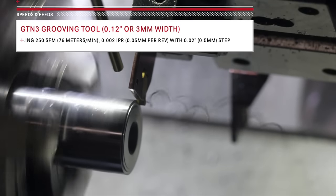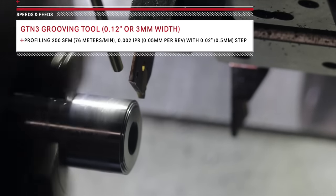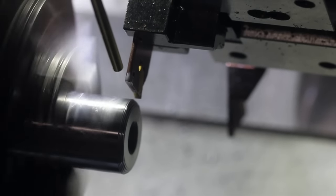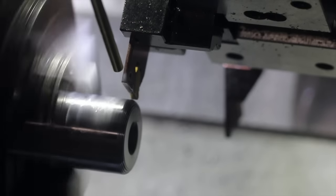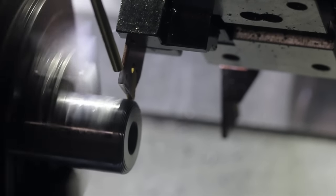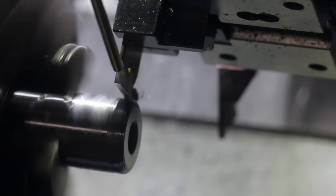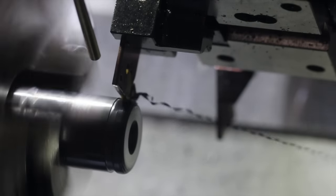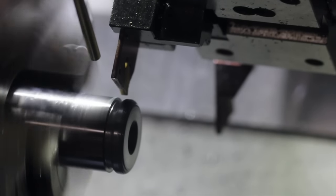I'm having an issue. We've actually been posting about it on some social media, Facebook and Instagram. I'm having an issue with getting proper outside radiuses with a parting tool in Fusion. And we cut a couple of sample pieces. Here's what's throwing me off: everyone's asking, is the tool modeled correctly, the width, the radius, all that. Here's the thing, when I do it in Sprut CAM, it cuts it correctly, which has me thinking it's either a setting in Fusion I have wrong or it's a glitch in Fusion, which honestly, it really could be a glitch. I gotta say, I think the Fog Buster is working okay, really.